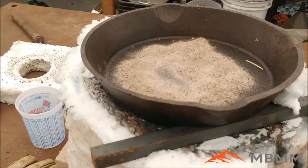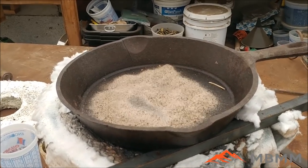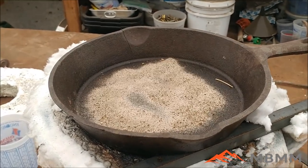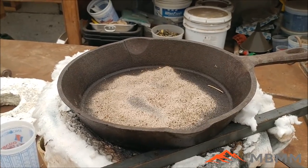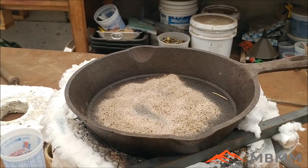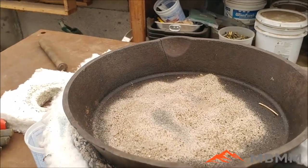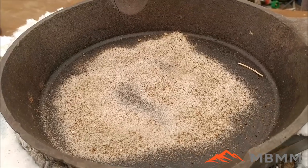I don't know the exact number but I expect it gets up to somewhere between 500 and 700 degrees Celsius. It doesn't need to be glowing red hot but it needs to get pretty hot, and after about 10 or 15 minutes it'll start smoking. The sulfur will start combining with oxygen in the atmosphere to drive off the sulfides and convert them to oxides so we can smelt them directly with the rest of our flux.